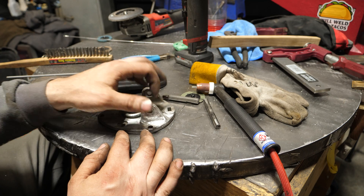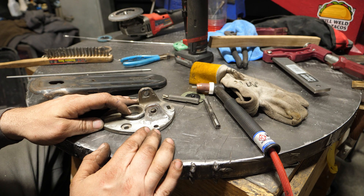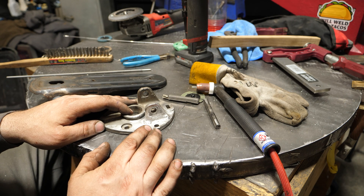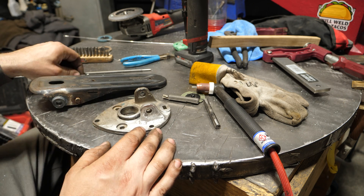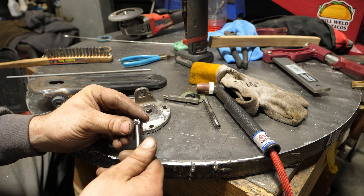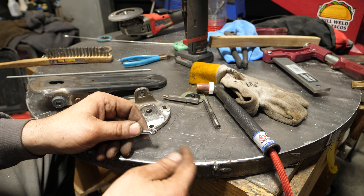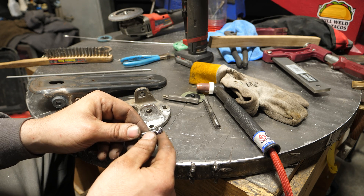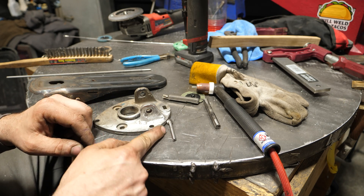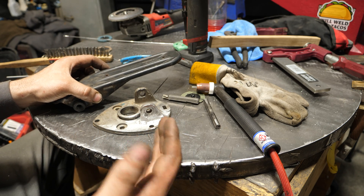This is definitely repaired. I can tell just by how it feels and the lack of porosity when I ground through it multiple times — this is going to be a lasting repair, so the customer will be happy. The soap trick worked great on the carbide burr — this thing isn't even loaded up. I just took a little metal brush and dusted the soap off and it's looking perfect. These bits are expensive, you don't want to throw them out unless they're completely worn out. The pin fits — I'll assemble it, show you that, and then we'll call it a day.